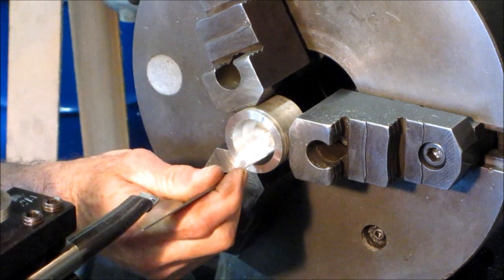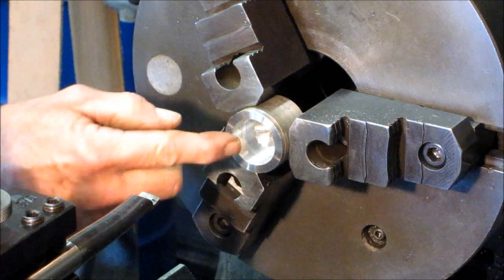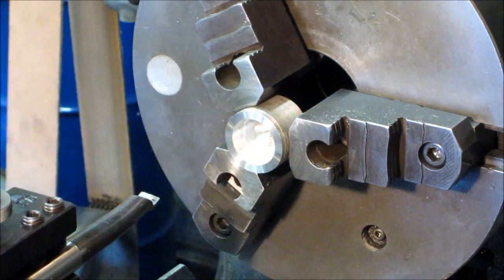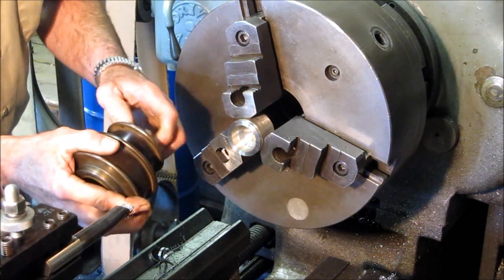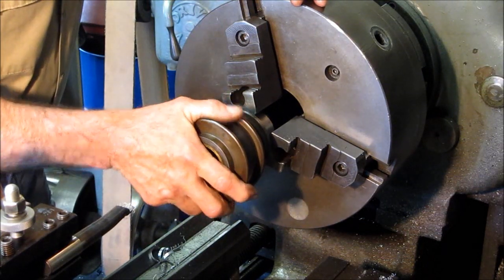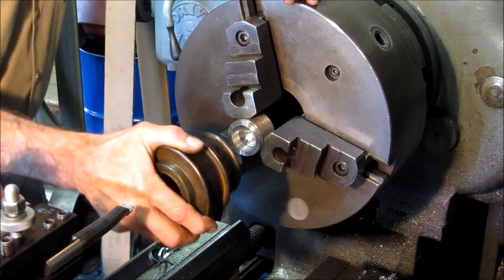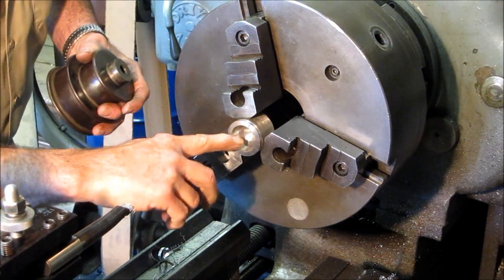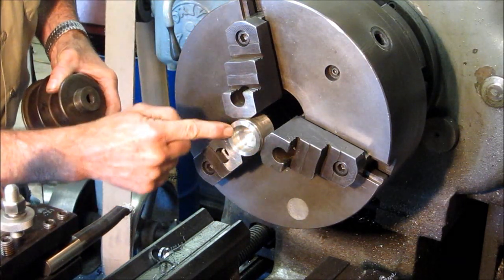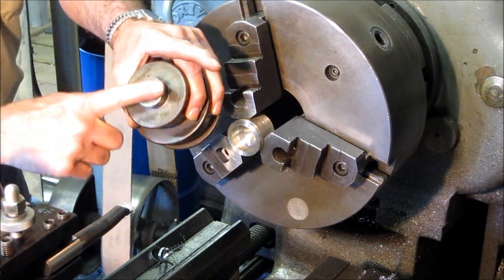That gave us a little bit of room — we got almost 600, so we've got plenty of clearance. We know we're not going to be hitting on the face, and we'll be resting out where we want to. We're going to chamfer that after we're done. We came down to size, tried it, it was a little tight, took another light skim and it's good. We just need to break the corner because there's a slight radius and we want clearance resting against this face — more purchase out here than pushing on that face.